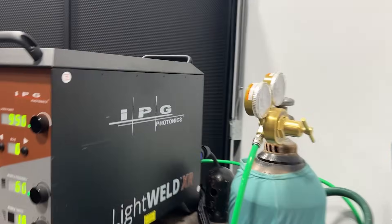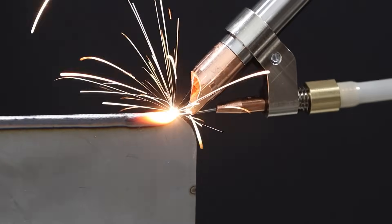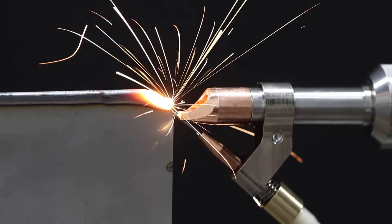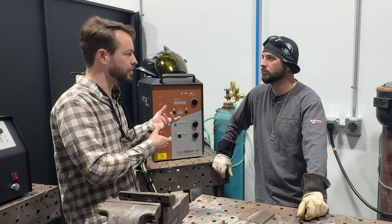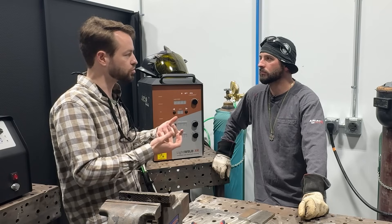What's the big deal with nitrogen being one of the main shielding gases used, and do you need it for more penetration? Your shielding gas isn't necessarily going to change your penetration when we're talking about inert gases like argon and nitrogen. The difference with nitrogen when laser welding stainless steel and carbon steel is it actually stabilizes the keyhole. What makes laser welding different from arc welding is that deep penetration creates a keyhole that pushes and cuts through your material. If you can't outrun your melt pool, it will collapse over that keyhole and entrap porosity in your part. Nitrogen is well documented in the literature to stabilize the keyhole and prevent collapse.